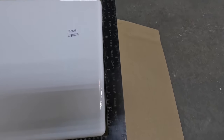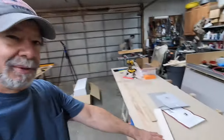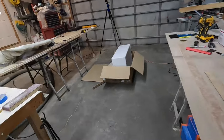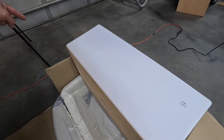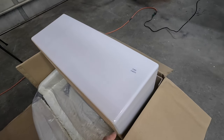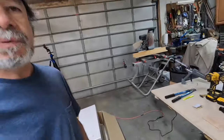So it's quite a gap. How will we perform this miracle? If you've been watching a few episodes ago, I showed you how to make a little template for a project, and that's what we're going to do here. We're going to put one piece across the bottom making contact with the bottom, and then put a piece going up on each side that will represent that cutout. If it's wavy or whatever, we might have to scribe it to fit — like a template. Let me get set up.